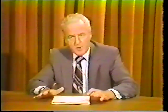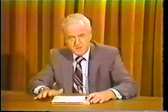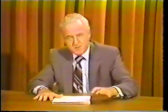Let's take a moment and review just what it is we looked at today. We talked about the necessity for getting a good, clean excavation and likened it to the pothole procedure, that is the squared sides and the firm base. We talked about the necessity for compaction, and that was certainly dramatized by the little training aid that Andy Nagy was kind enough to provide for us, showing how the compacted material actually shifted under pressure and how material that is not compacted will give you pipe failure.